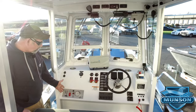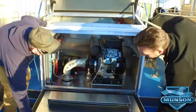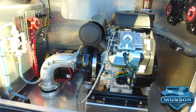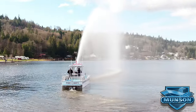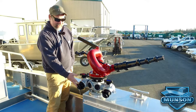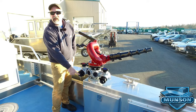The port side of the console is equipped with a fire pump control station. The fire pump is located in this locker just forward of the wheelhouse. The fire pump is a Hale ATTACK MAX rated for 500 GPM at 100 PSI. The Hale fire pump supplies water to this TFT boom base. The boom base is outfitted with gated elbows that have both two-and-a-half-inch and one-and-a-half-inch national hose fittings on them.